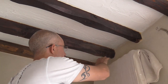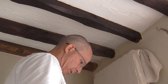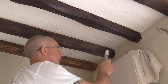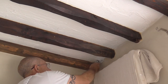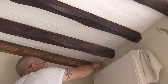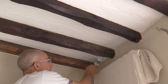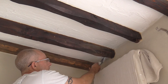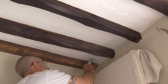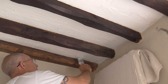I'm going to start in this corner and bring two coats in at the same time — it's a bit quicker. Starting off with a small brush, I'm going to overlap the paint slightly onto the wall. You never really want to go too much onto the wall, especially with white, because when you come to put your colour on you'll just find it harder to cover up. I'm going to use my small brush for the minute while I'm working in this corner, and then once I get out of the corner I'm going to swap over to my big brush.